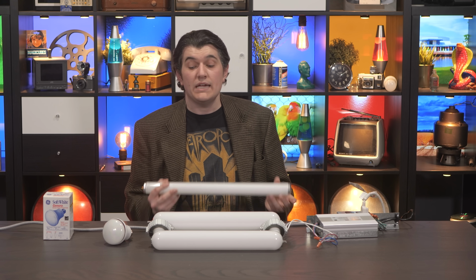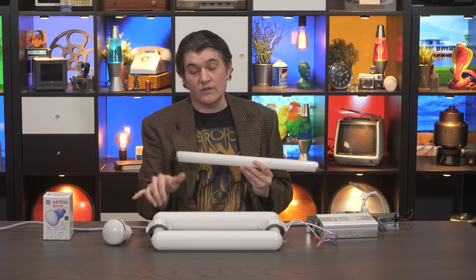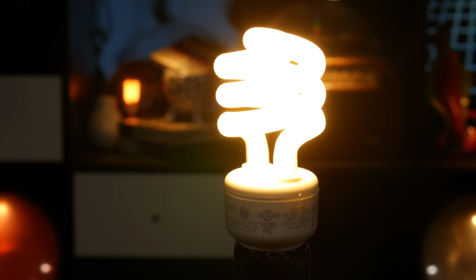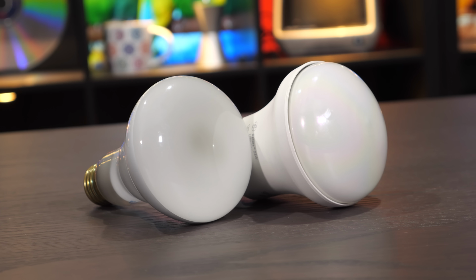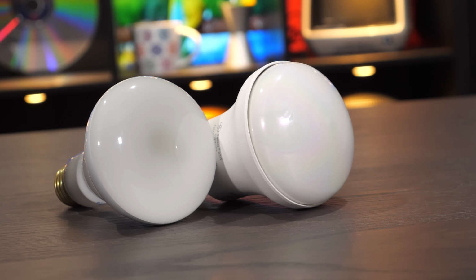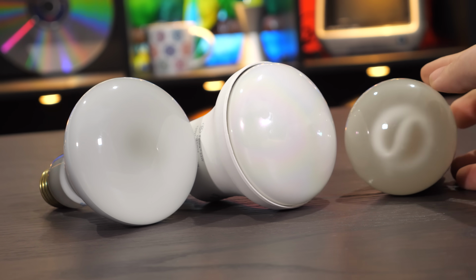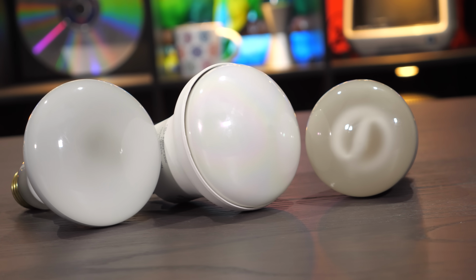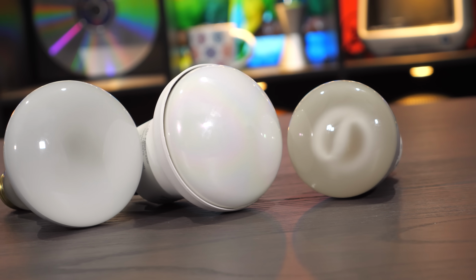As a matter of fact, a bog-standard T8 tube is more energy efficient than either of these induction lamps. And then of course there's the CFL. Those too got electronic ballasts and all the benefits thereof, and they were available in much more modest power outputs than induction lamps. Sure, the Genura lamp is a more elegant solution than sticking a coil in a fake bulb, but is its elegance really worth the extra cost? The market clearly decided, no it wasn't.